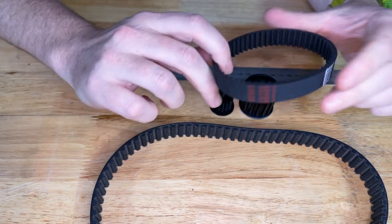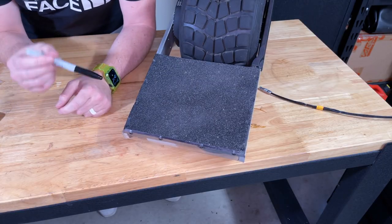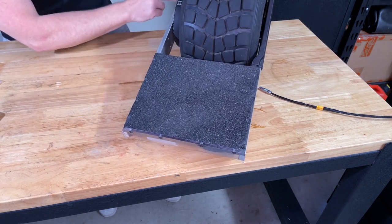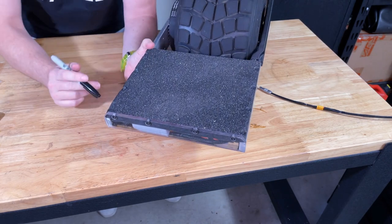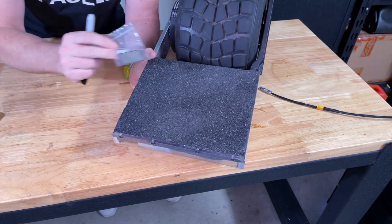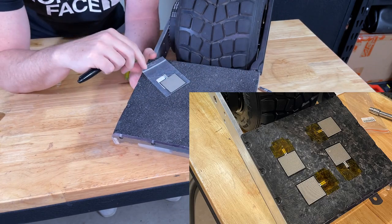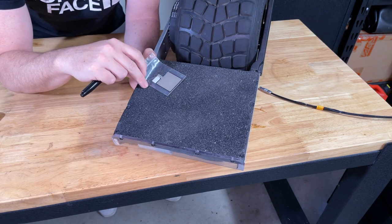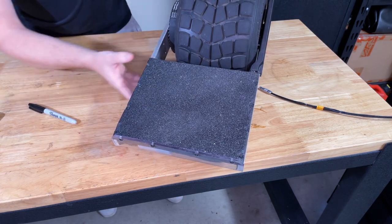Back to the board itself. Unlike one-wheels, the battery is actually in the front of this one. That was done because the motor compromises the amount of ground clearance you have at the back, so I wanted more ground clearance at the front in case you're going up a curb. The front end isn't too different from a typical one-wheel. I used four force-sensitive resistors for the footpad — two wired in parallel on each side. I wouldn't do that again; I'd just buy one of the aftermarket footpad solutions to make wiring an awful lot easier.